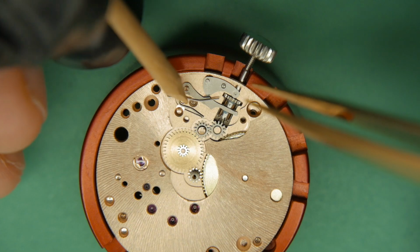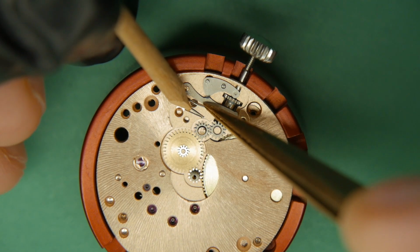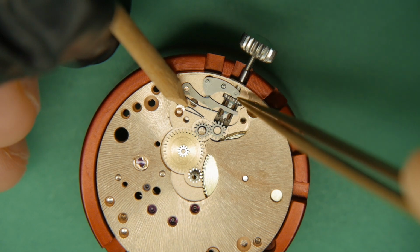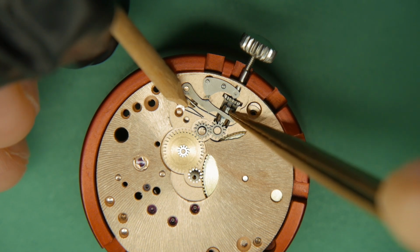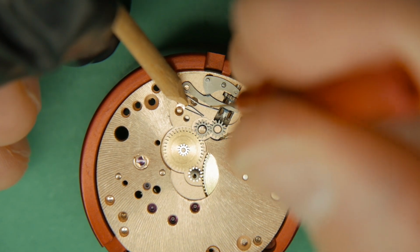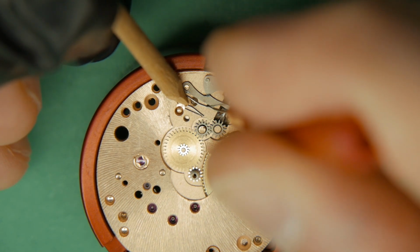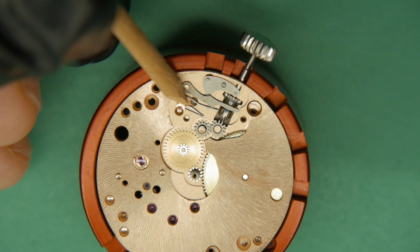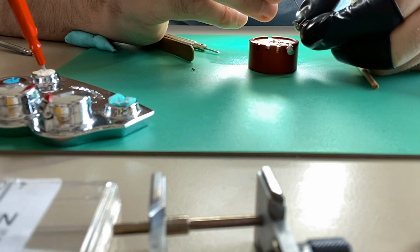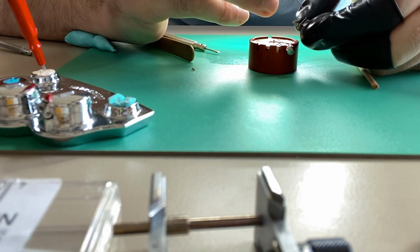So just adding in the yoke and the yoke spring, and then I just put it onto tension. Again, while I'm just holding it down with some pegwood as well, I want to make sure that it's engaging, and at the same time, while I'm currently in this position with my hand, I just get my oiler and I just slide in a little bit of 1300 between the spring and the yoke, just so that it's got a little bit of lubrication.